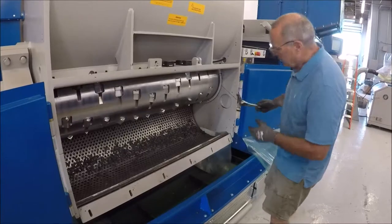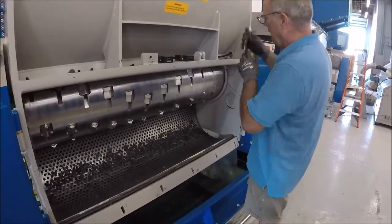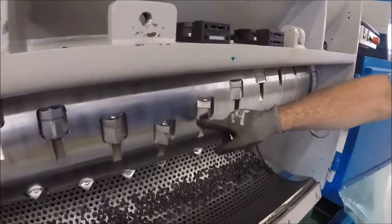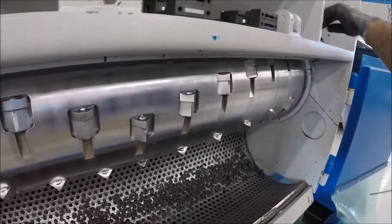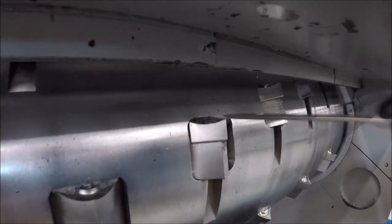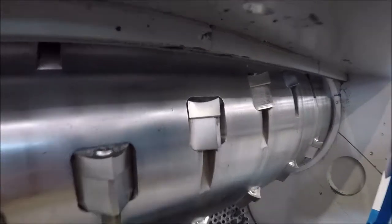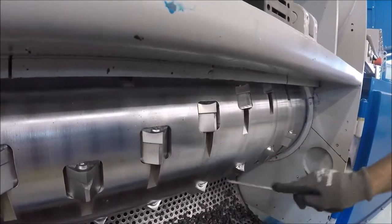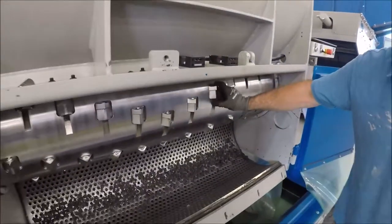This machine has 68 knives in it. You just have to take the knives out — you crank on it, the bolt comes undone, and then the knife becomes free. The knife holder stays in the shredder and the knives come free. Where most of your material is going to build up is in the front of the knives. That's where your material is going to build up. Once you take the knife out, this enables you to get out all that material. You then take either a knife or something else and clean out along these sides and the back.